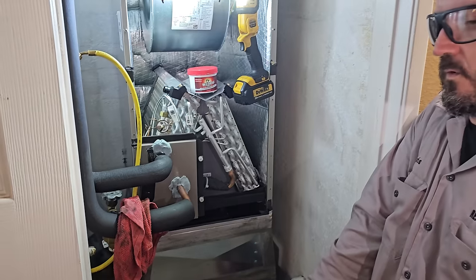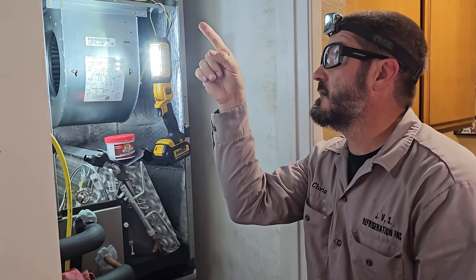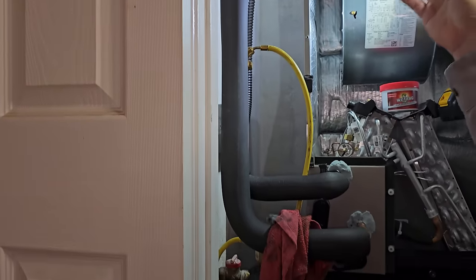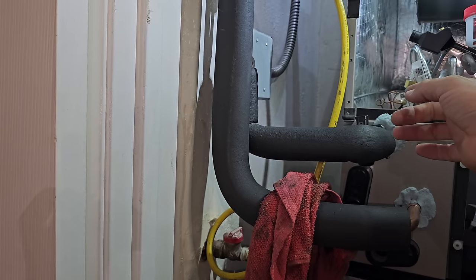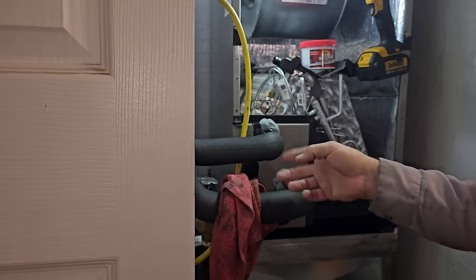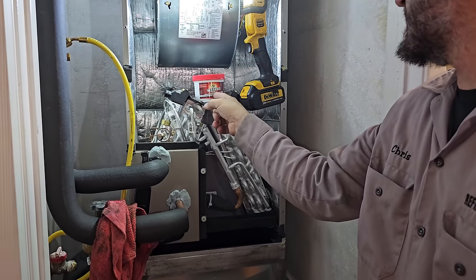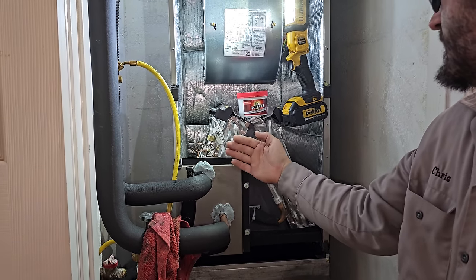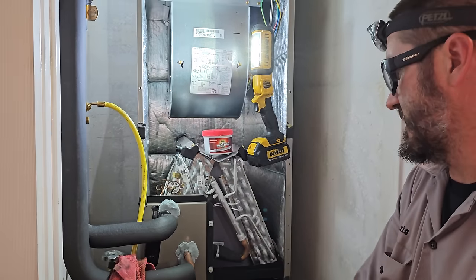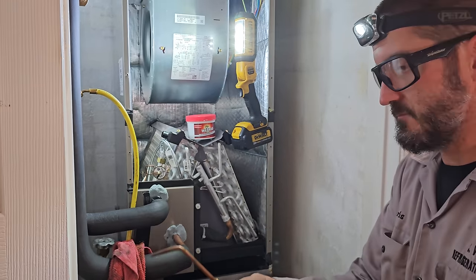All right, so we Zoom Lock Maxed the catch-all, the ball valves, the see-all sight glass. We press those on, okay? But we still have to braze these connections right here. So I've got nitrogen flowing through the system. I'm utilizing one of the ball valves that I installed. I put some of the Viper wet rag heat blocking compound on the backside and the front side to protect everything, holding back the insulation. And we're gonna braze these up real quick, hopefully without causing a problem.